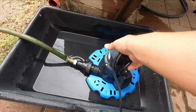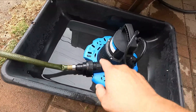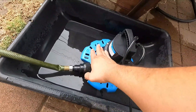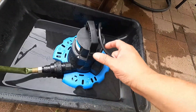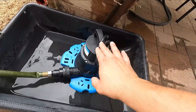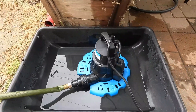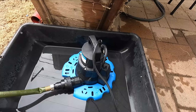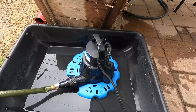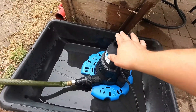The pump automatically detects if there's water before it starts turning on. The attachment is a plus for the water hose. This is not completely submersible — it's recommended to keep the electronics above water, maybe up to two inches or so. It has a handle if you want to target specific areas like a puddle. Always keep the water flowing — if you stop the flow you might damage the pump. It will automatically turn on when it senses water, so be aware: if it's plugged in outside and it rains, it will activate.